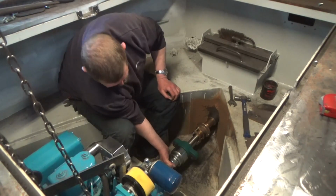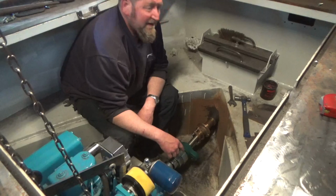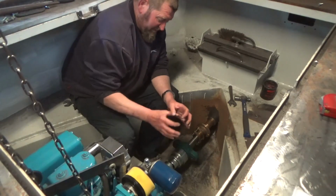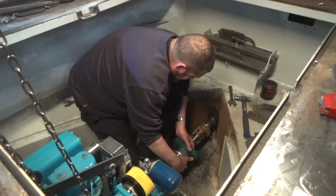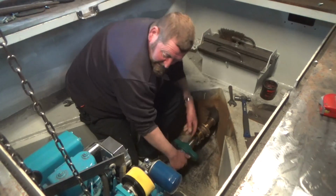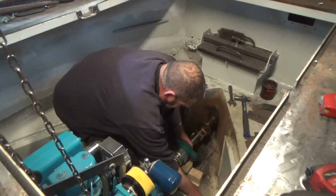I'm thinking why I'm sat here, you know what, I'm making life easier for. So we made a couple of screw jacks, a little bit of tube, and then the bolt and a washer, and just a little V on the top of the couple of feet. Then we can just position this, get all those measurements right, move it sideways, get it lying, everything else, just a tiny little movement.